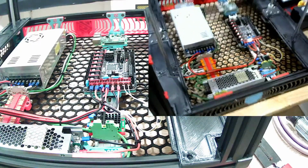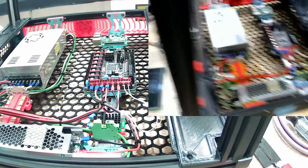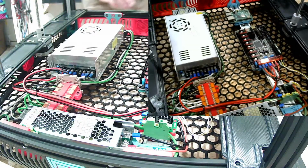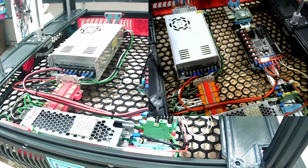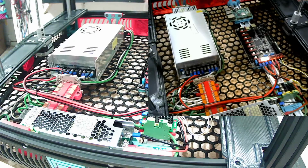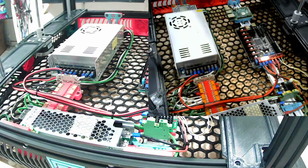Back here for a minute. We've got all this pretty much done. So the Raspberry Pi, to get its power, we need to sacrifice a USB connector, or the other dangerous way would actually be to use one of the GPIO pin 5 volt supply to power the board from, although I can't remember where I heard that they say it's better to power it from the USB-C port because there's a built-in voltage protection, so that would be nicer. But basically, from here to the Pi, that's it.